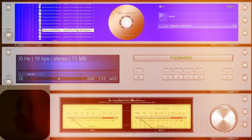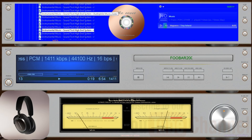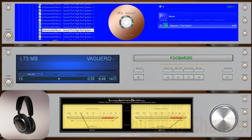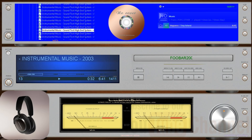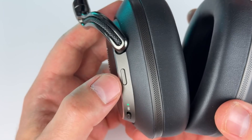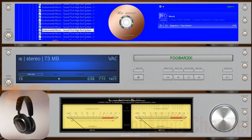Let's run the acid test. Our methodology is to send the PX8S2 a bit-perfect 24-bit, 96kHz signal from a PC running audiophile playback software like Roon or Foobar 2000, set to an exclusive mode like WASAPI. This bypasses the computer's own volume mixer and sends the digital file bit by bit directly to the PX8S2. The source volume is set to 100% — the file is unchanged. Now we use the physical volume buttons on the PX8S2 itself. When you press volume down on the headphone, you are not telling the computer to chop up the signal — you are sending a command internally to the PX8S2's 24-bit DSP.